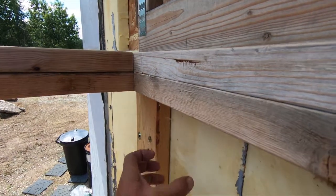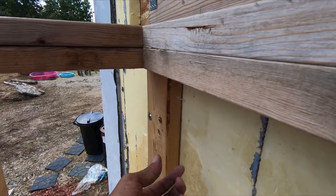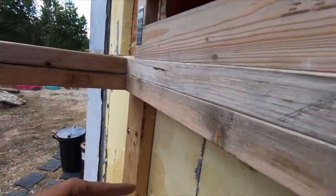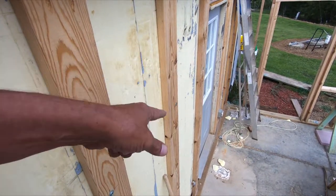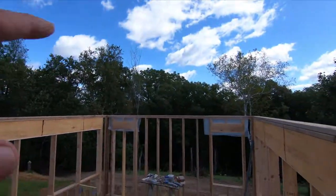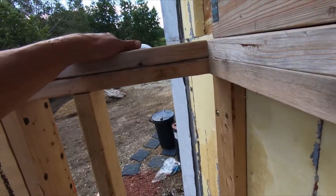This is just going to come in and then have a valve right here with a threaded end on the end of the valve. And I'm going to transition to PEX. Then it has to come over here and down to a water heater and a sink, and then it'll go that way, so it'll have to come back up and through again.